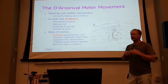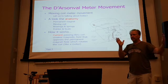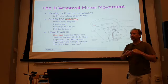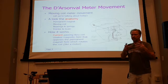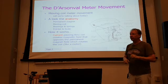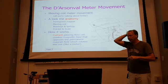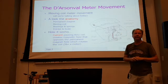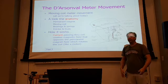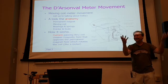So, from 1964 or something like that, and how you can use that with the null to get down to, on a 10 volt scale, get to like 10 microvolt precision with an analog meter using null measurements by precision voltage reference, precision dividers, and null that out. So I do have that one video. If you do go to my channel and search for a Fluke differential voltmeter, you'll see that, which I used it for the video, and it's back on the shelf, and I haven't used it since.